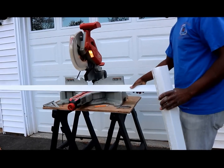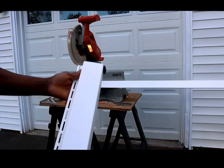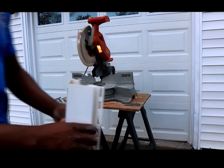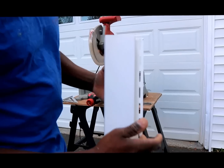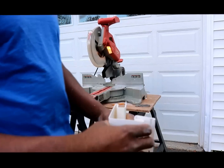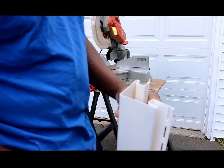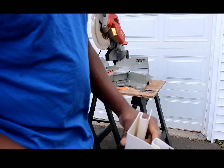So we are ready to install, but before I install I want to make sure we have all the information we need. This is a leftover piece of the new corner. On the wall, the corner has the nailing flange right here and it is all filled up with nails, and the siding overlaps it so you can't see those nails. What we did was rip the existing corner down on the wall, and on the new piece we ripped it down here so this is going to overlap the old one.